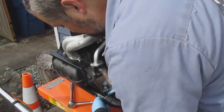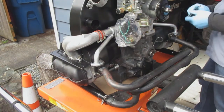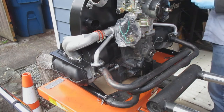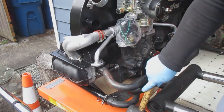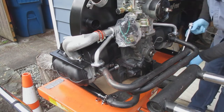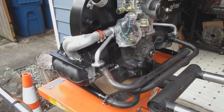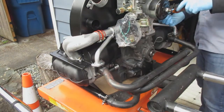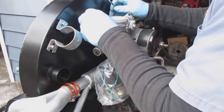After the muffler is on and the J-tubes are inside the muffler pipes, I tighten the J-tube 13mm nuts — two on the back sides of each head, and the tubes on the front sides. After that's all tightened up, I put the clamps from the J-tubes to the muffler. Sometimes I have to tap them with a rubber mallet to make sure they seat properly, since these J-tubes are a little smaller than the pipe clamps installed. Hopefully there are no exhaust leaks.